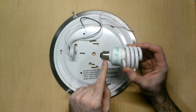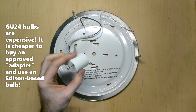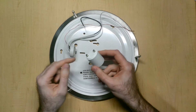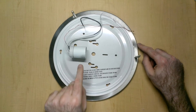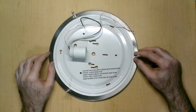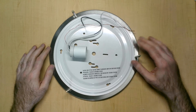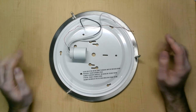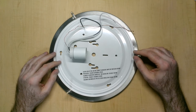But I have an Edison style connector. So how am I going to get this to work? You can introduce one of these devices - a GU-24 defeater or adapter - that sticks in here and gives you an Edison connector. Now in some states these are highly illegal because you can potentially insert an Edison style light bulb that overcomes the rating of this lamp fixture and potentially cause fire. So don't do this unless you've spoken to an electrician and have their sign-off, and everything is legal in the area that you live in.